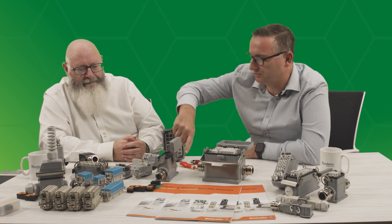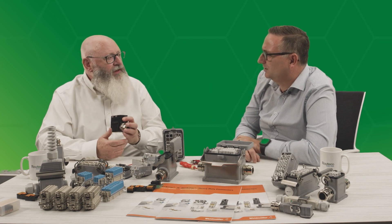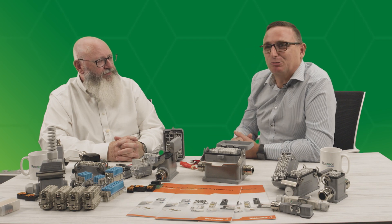What's the difference between the black hoods and the grey ones? The black hoods are our EMC hoods — they're still IP65, but they've got the EMC moulding on the side, and because the seal is hidden from daylight these are suitable for outdoor use as well. That's great — thanks very much for that, Ivor. I hope this video gives you a better understanding of what the Weidmüller HDC heavy duty connector product offer looks like. I've learned some stuff today and I thought I already knew this product well! If you're looking to know more, please get in touch with your local Rutiko sales representative or use the link below. Thanks for watching — please subscribe to our YouTube channel and hit the bell to look out for the next Gin with Spearing video coming very soon.